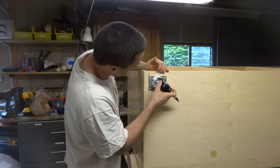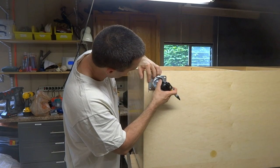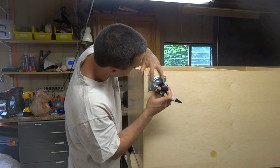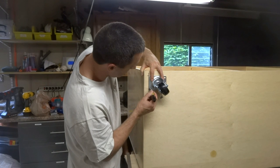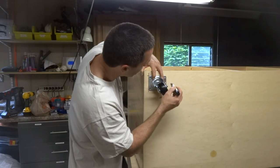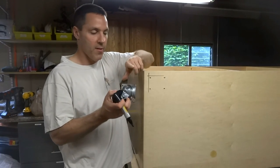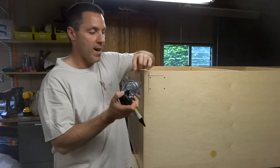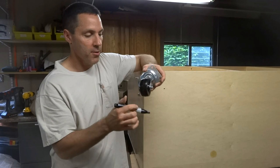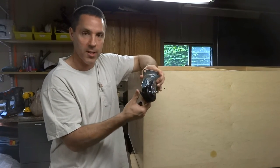And so then I know when I want to attach the wheels that I just make the two lines parallel, and I can go ahead and hold it there myself and make a couple of marks for drilling out these holes. Now, I want to put bolts in there without a lot of blocking underneath this, so I've got to find some 3/4-inch bolts that I can put on, and with this roughly 1/16 to 1/8 inch plate, it's going to be okay. The other thing I did was I got locking casters for this one so that it's not going to move and roll on me while I'm trying to work on it.